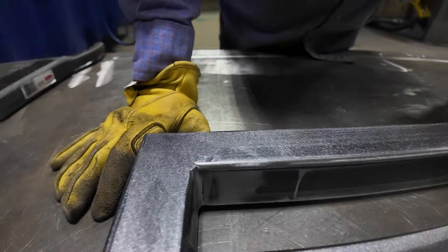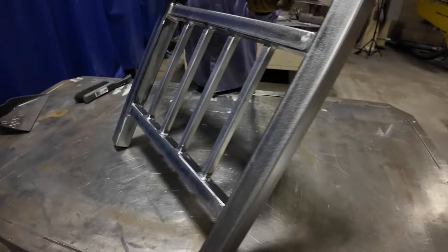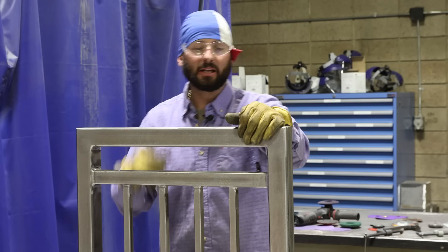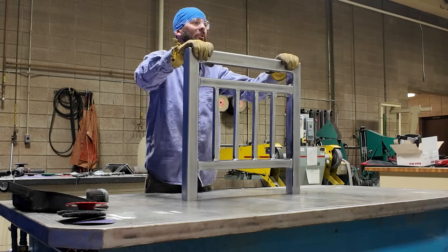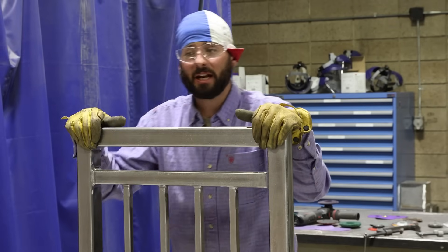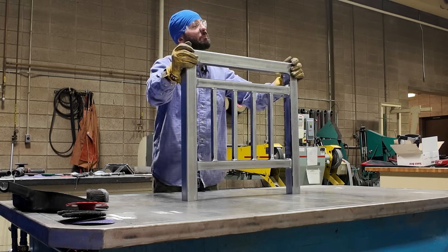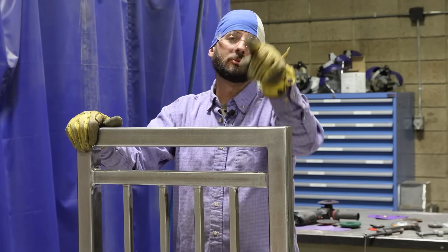There's a lot of good things I'm seeing here — my corners are really clean, the lines are really straight, my edges are sharp, my caps are sharp. What I don't like is maybe I needed a smaller belt to get into some of these spots and corners on this smaller tubing because I did a little bit of over-grinding. As far as grinding marks and all that goes, we're good — we're ready for three mils of paint. And again, if you didn't want to put this finish with an orbital on there, you could have stopped with the Scotch-Brite wheel. Everything that you've seen in this video today, you can find more information down below in the links in the description so you too can put a proper finish on something and charge more for your work. Hope you guys enjoyed this video — we'll see y'all in the next one.